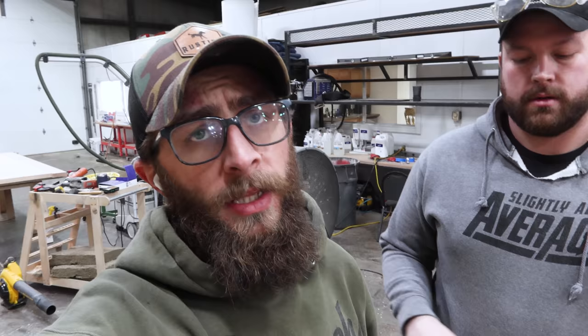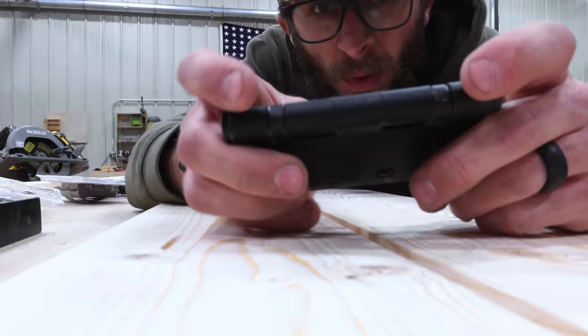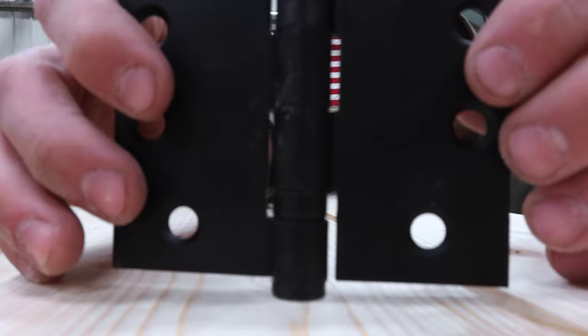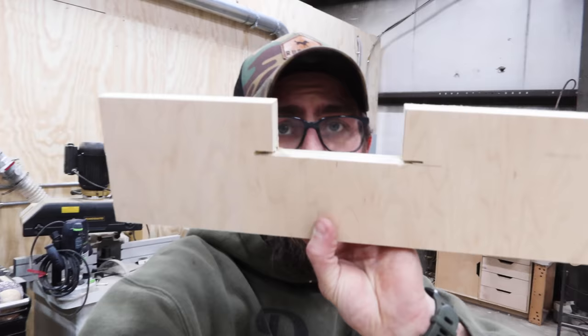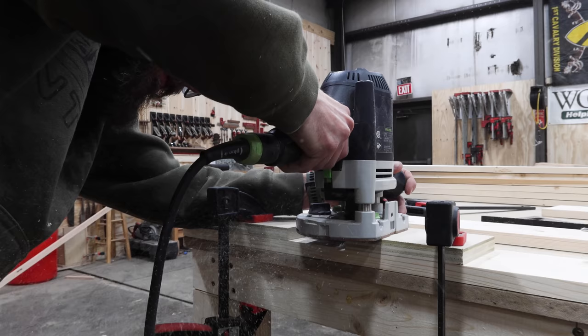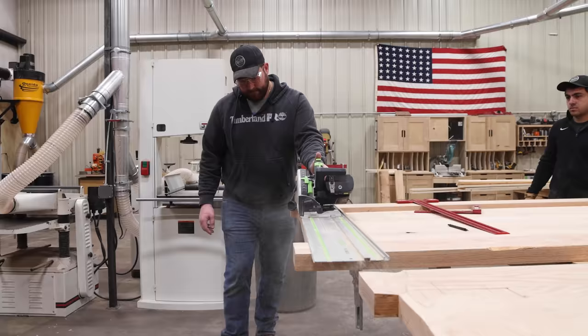I'm gonna start trying to lay out hinges - and eat cheese crackers because I'm hungry. We're going with a ball bearing hinge, just like a regular hinge but with two ball bearings that hold the weight a lot better. Two on each door. I tried to do four but spent the whole morning trying to find them - Home Depot three times, Lowe's once, Tractor Supply once. We think we can make two work. I made a little jig that's the exact same size as the hinge.